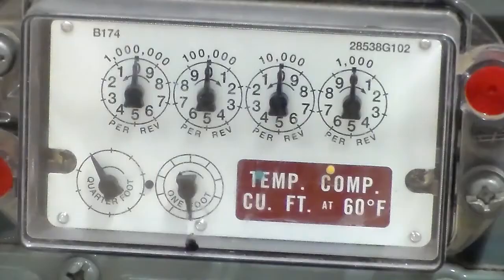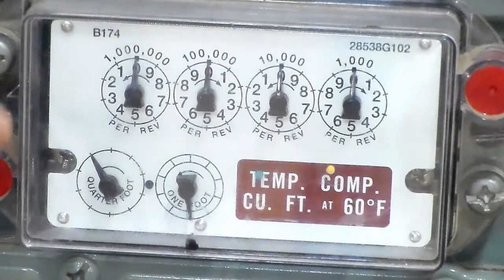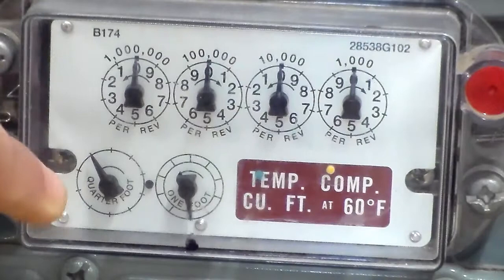Spot check — they might say 'what is a spot check?' or 'tell me how to use the meter to check for leaks.' All we're doing is coming out to the meter, marking the quarter-foot dial (the smaller one), going away for some amount of time, then coming back to make sure that quarter-foot dial didn't move. If it moved, you have a leak. Do this with everything shut off but all the gas turned on.